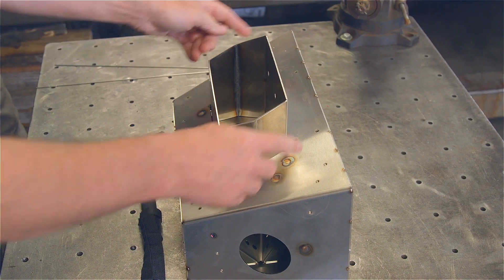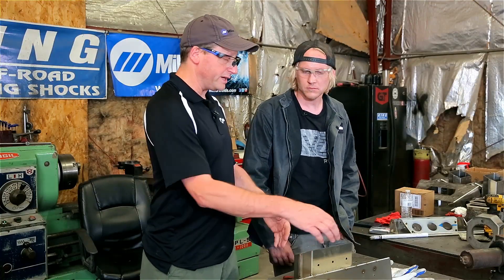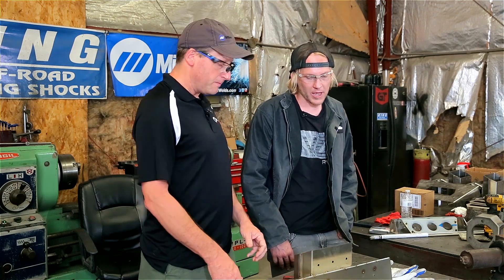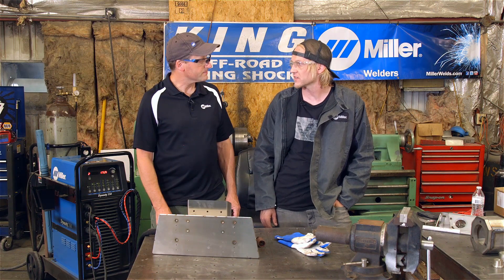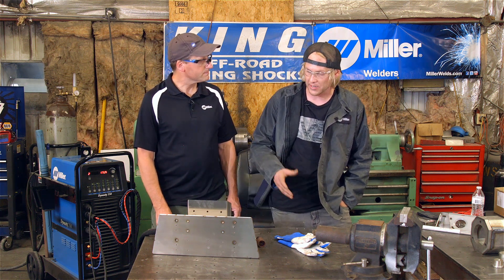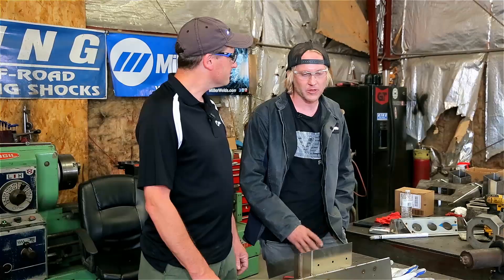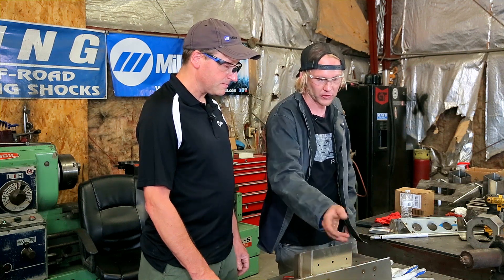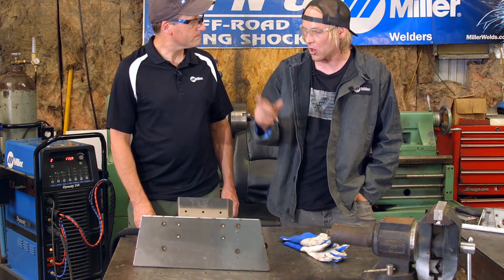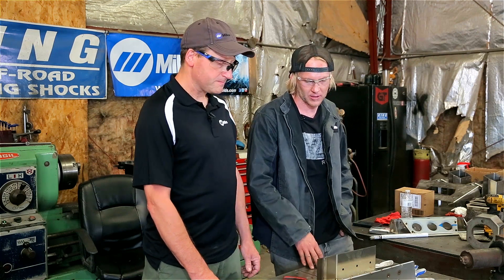I love the design of your muffler here. The way you have it shaped and the way the internal baffles are actually plug welded first to keep the rigidity of the muffler in place while you weld it. Otherwise, when welding stainless, you would want to skip around some on this type of weldment to keep the warpage down. Yeah, absolutely. We've noticed on some of the other stainless steel products that we've built that it is a very sensitive material. Heat input typically results in a lot of waves and dents and pulling. On the design side, if you can ever incorporate flanges or square edges or something that you can attach to, that typically will build you a better product. We have baffles within the muffler that have spot welds basically on every surface, so there's not really any length of can longer than two inches that doesn't touch something on all four sides. Lots of revisions and a lot of product development, but we finally have something that is ideal.